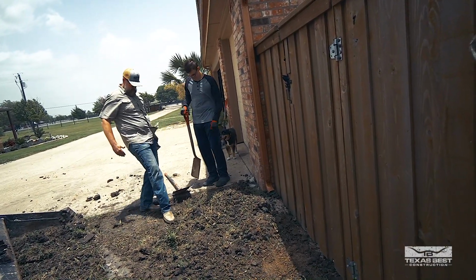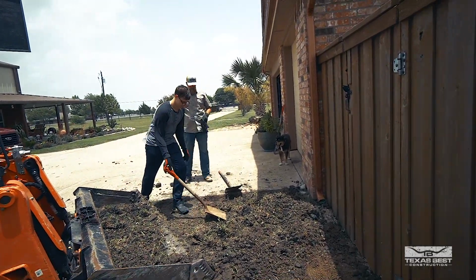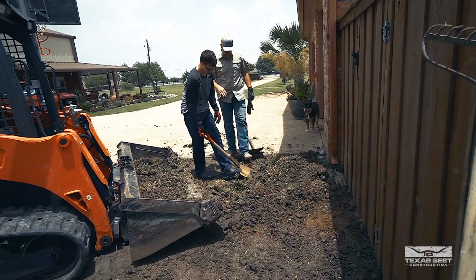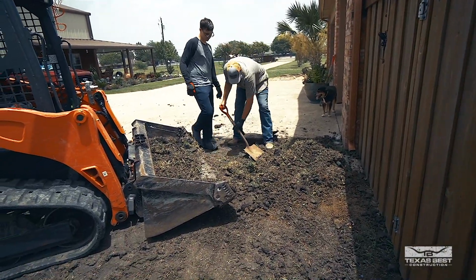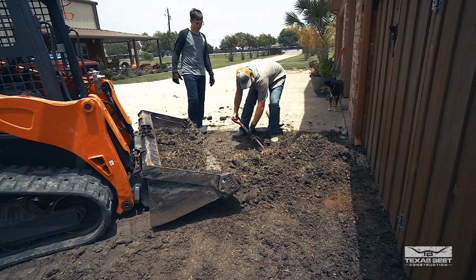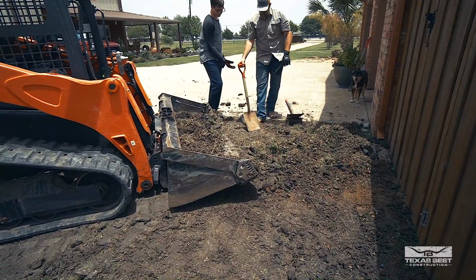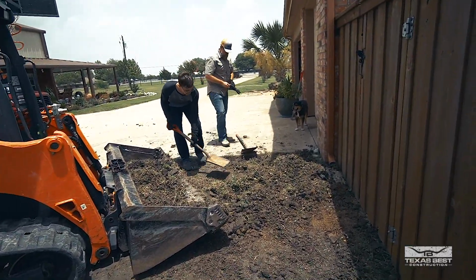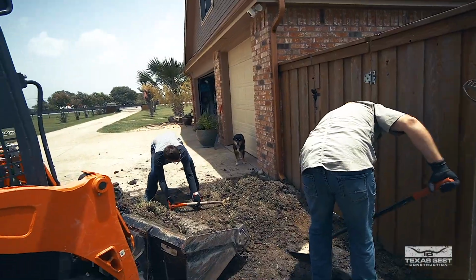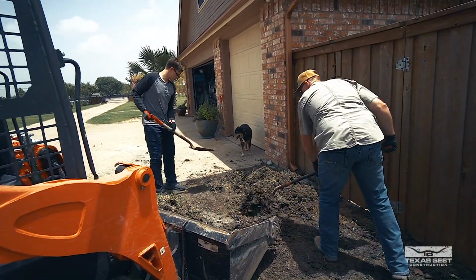Look, you want to slide under, you see where the grate is right here? You want to go straight and get under that loose dirt right there. You can flatten your shovel. No, not with your foot. Flatten your shovel right here. See? And go straight right there. That way you're kind of like grading it. It's a little muddy, so you have to kind of work with it a little bit.